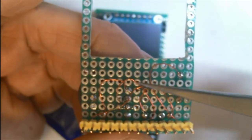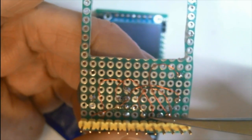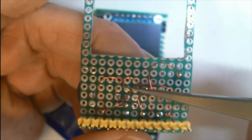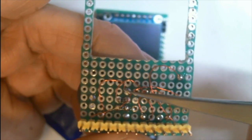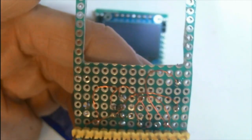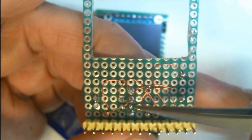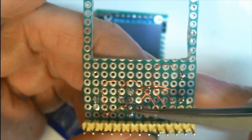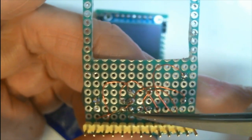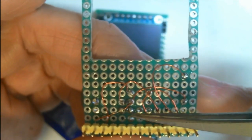2.2K before it goes into one of the button inputs. For this one, I choose A3, the analog to digital conversion input. The last pin, which is the other side of the VR, we hook up to VCC directly. The reason why we need to use some resistor is to avoid some situations. For example, the resistor 4.7K to ground will protect us against accidentally triggering a button press.